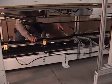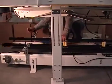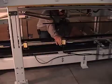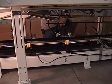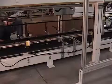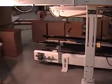The case feed unit includes powder-coated guide rails that provide easy and efficient job changeovers. New swivel-mounted and pivoting quick disconnect photo eyes and reflectors are now included throughout the packer. This redesign provides for simple adjustment and replacement. Two 6-foot guide rails on both the front and back end of the unit also feature simple height adjustments.